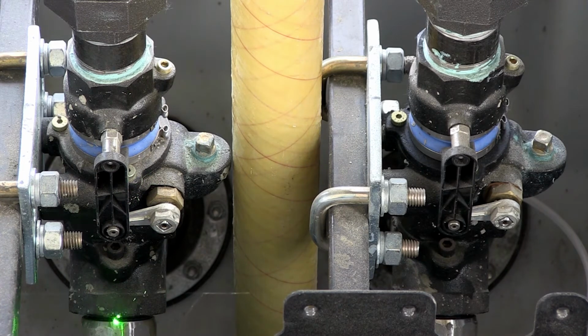You're also going to look at the piping. Make sure there isn't any leaking in the piping or any of the connectors. They've placed the sump sensor inside of a fiberglass piece of pipe to keep it in an upright position and sitting at the bottom of the sump. Also, as far as under dispenser containment goes, the piping that's going inside also has to be installed properly.